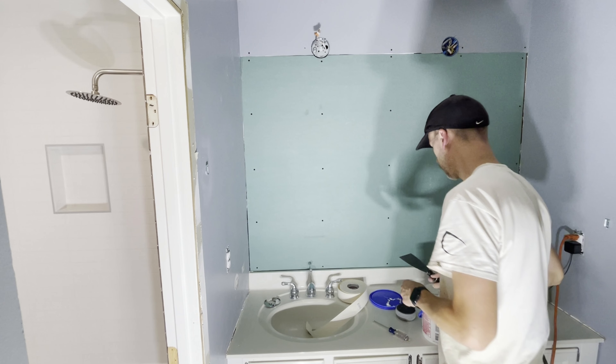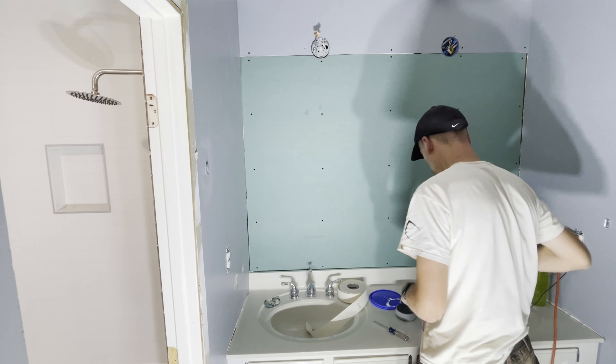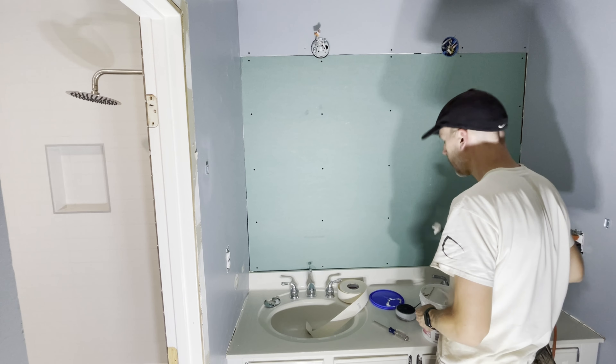You can see here it was pretty simple, just one piece of drywall. I pre-cut what I wanted to get rid of the old drywall to four feet so that I knew I could put this right in there. I just had to trim it to length, because it comes in eight-foot sections. And you can see the screw pattern there, just pretty simple.